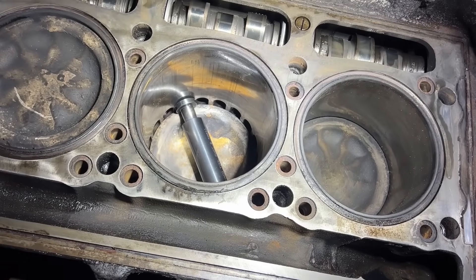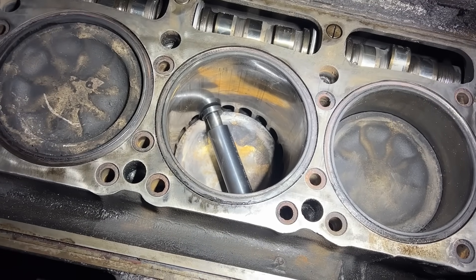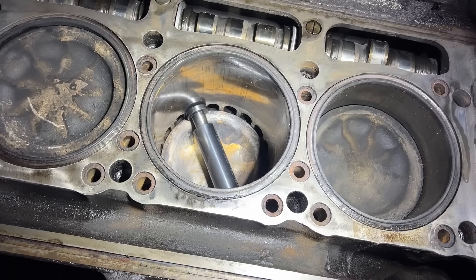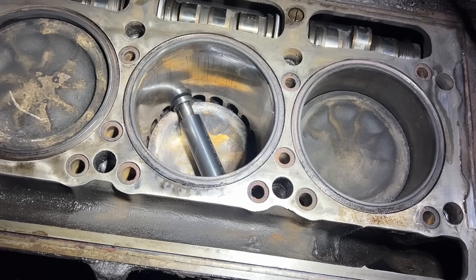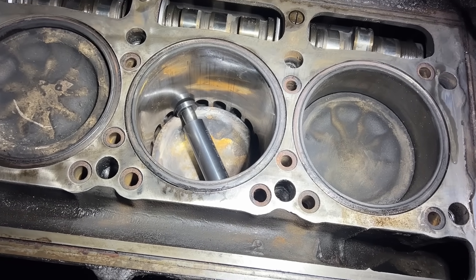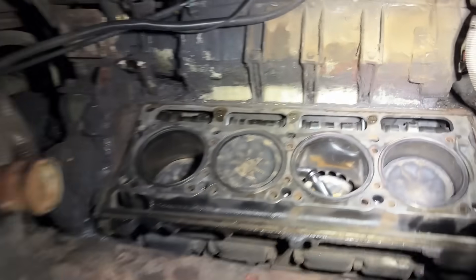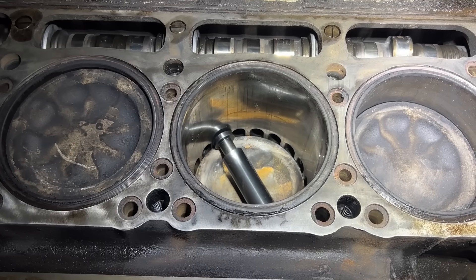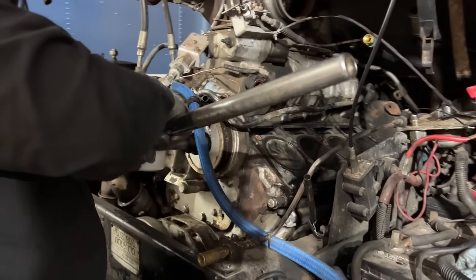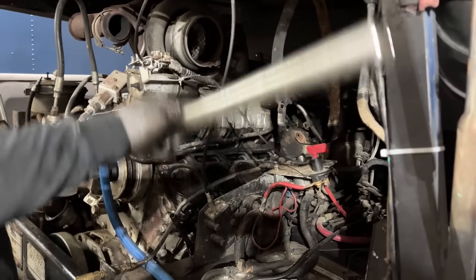It's going to get really hard as you're driving the liner up. I think we need some more leverage. You've got a three-foot bar — want to slide a longer bar on it? He's going for more leverage here. We got this extendable ratchet from Easy Red — it's got a collar on it and gets really long, it's a three-quarter inch drive. Hopefully this will give him the leverage to pop that liner out.